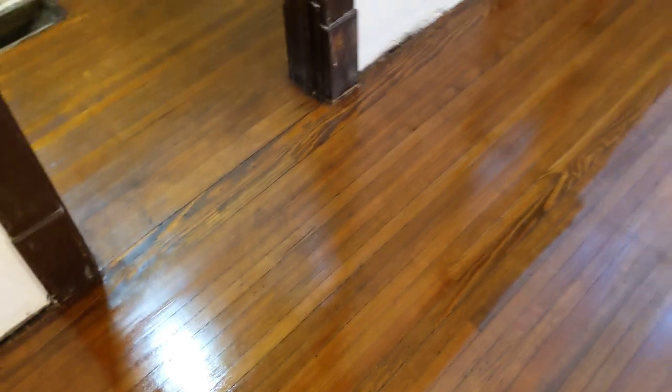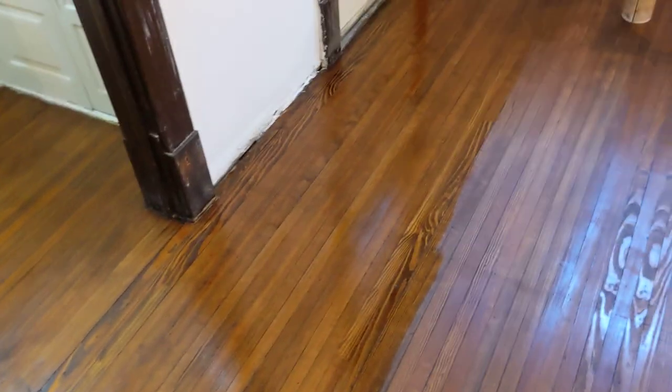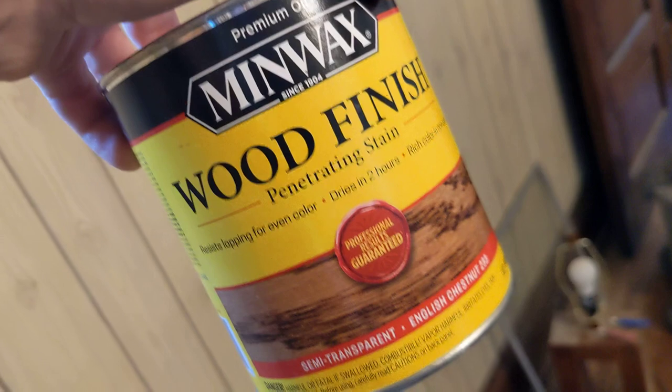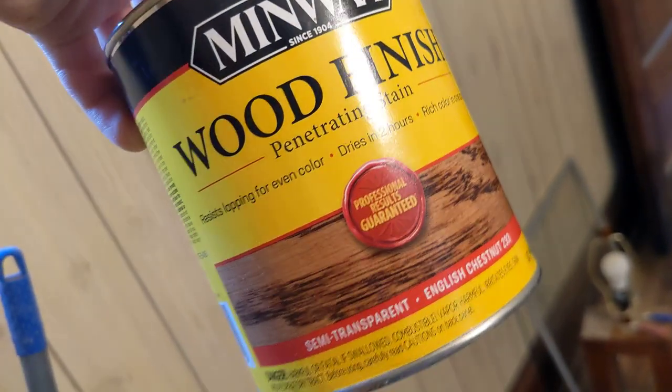I'll put some pictures up for the final product. It's truly a beautiful floor finish — I haven't worked with this before, it's my first time, but it's very, very simple, easier than the stain was to put on. If you guys are curious about what stain that was, I actually have some here I can show you. It really turned out good — that's pine wood, or Douglas fir, some people call it. I'm not sure if there's a difference. I let two days, or 48 hours, of cure time before moving forward with the shellac. I hope this video helps you guys — thank you.